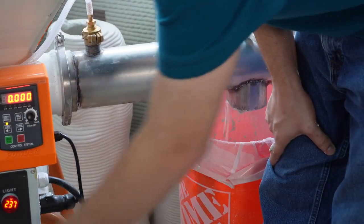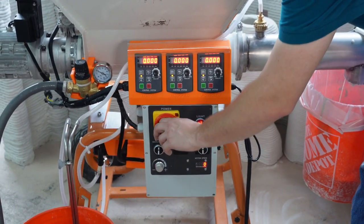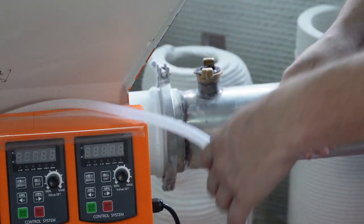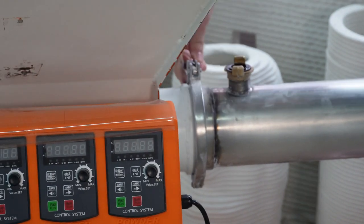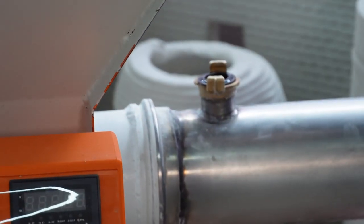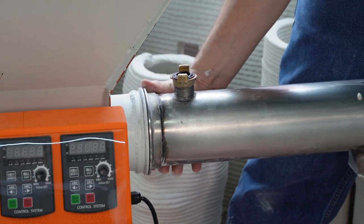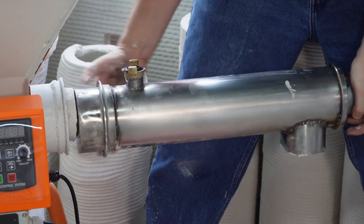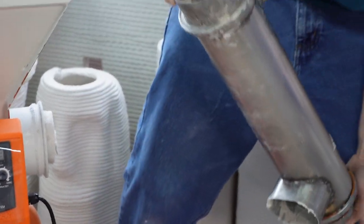Turn off the water and mixer. For safety, always turn off the main power switch before removing parts from the machine. Disconnect the water hose from the mixing chamber and undo the securing clamp. Make sure to not lose the clamp. Pull off the mixing chamber — if there is resistance, you can use small back and forth movements to pull it off. Grab onto the mixing paddles and pull them off with the chamber if needed.